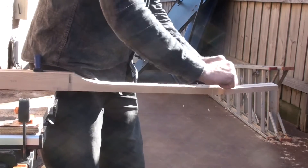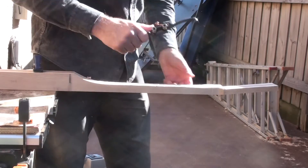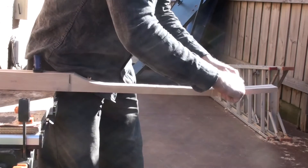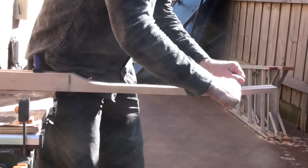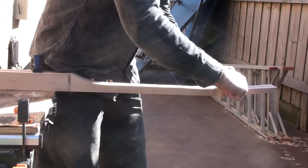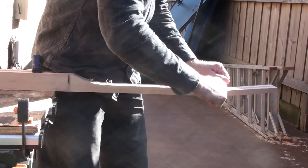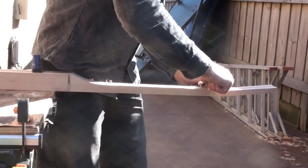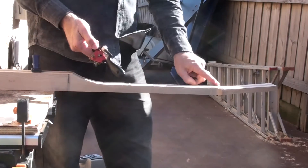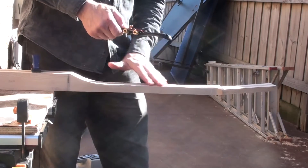Going this way, it's basically fixing up without a problem. So this direction it doesn't seem to mind. But with this spotted gum, because the grain moves around so much, it might be fine here and then I get down further and have to go the other direction. Time will tell. It seems I need to learn more about grain direction. When going that direction, the spotted gum tears out. I smooth it out again and then a couple of light passes this way — and I get that tear out. So it's got to go this way at the moment anyway.